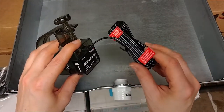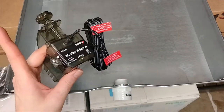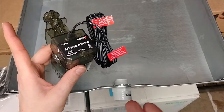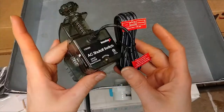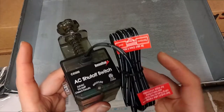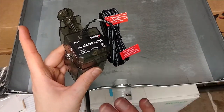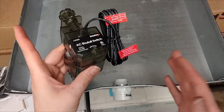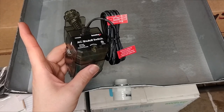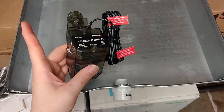What I don't like is when someone talks about just jumping around the float switch to see if it works. If you jump around the float switch before going through diagnostic steps, of course it's going to work because you've essentially wire-nutted around your safety device. Make sure you have reset it first. If you plug it in and everything's still not coming on even after you've reset the power — and remember, some units have soft lockouts where you have to actually reset the power; I've come across a few Daikin units like that — make sure you reset the power.